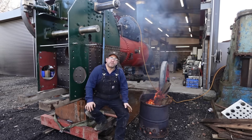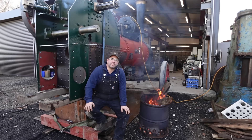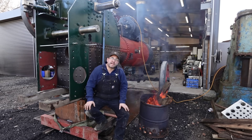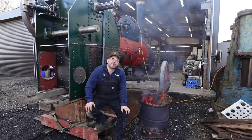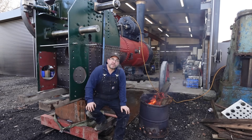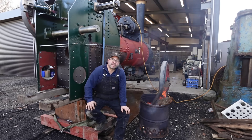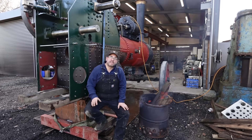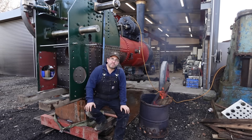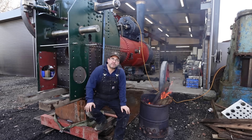The reason we fill the boiler with water to the brim is a safety thing for those that are new to steam engines. Water won't expand if we did have a crack, a split, or a burst rivet — the water won't expand when it comes out. Whereas if it was full of steam, it can get quite nasty and be devastating, really. It could be an end-of-life opportunity. So that's why we do it with the water — if anything bursts, it just lets the pressure out and we're perfectly safe. Whereas steam expands with huge amounts of power and could blow the engine to bits.